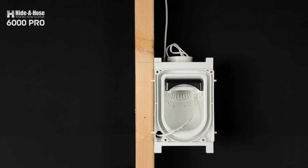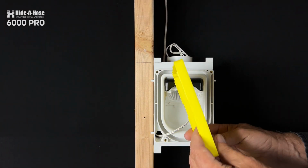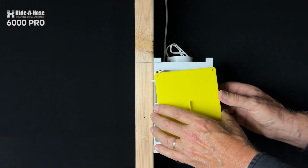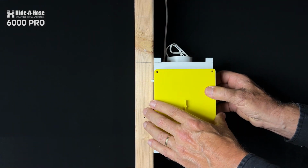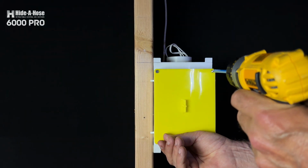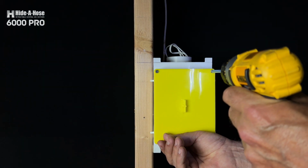Our goal was to ensure that drywallers will not cover the valve. The raised design and yellow paint of the new mud cover should prevent them from ever covering. The thicker edge will give drywallers a guide to cut their hole, hopefully making a more accurate cut. The raised mud cover also gives us room to store our low-voltage wire.